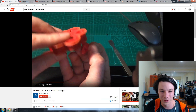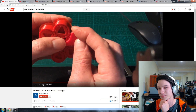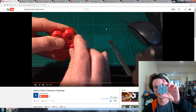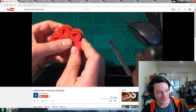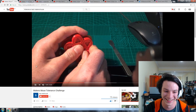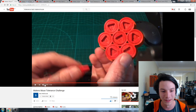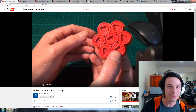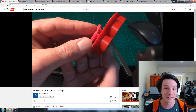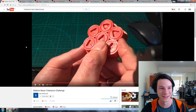And then I believe you got 0.15 clear as well. I just had trouble with this one — 0.15 did that. Always good when the plastic cracks. So Ben got 0.15 clear, which is pretty admirable considering it's ABS, which is a lot harder to print. You've laid down a really thick brim to stick that part down and you're managing to get 0.15. Congrats, well done.